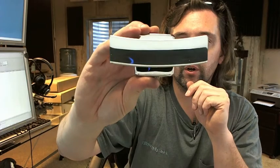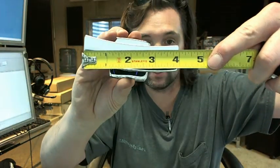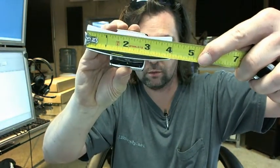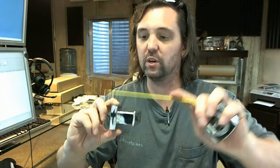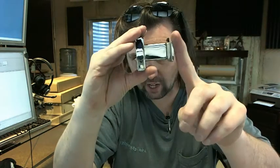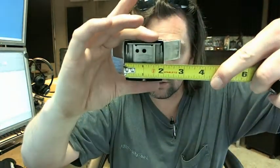Concealed mounting — I'll show you that in a moment how that's accomplished. Let's go over some dimensions. Bobrick is saying that this is a 4-inch hook, meaning the overall width is 4 inches. The projection is about 2-1/8 inch, about 2-1/4 inch from the wall to the outside of the contour, and about 2 inches to the center. The dimension of the mounting pad is 2-inch by 2-inch — a standardized size base for many other types of hooks.